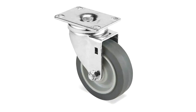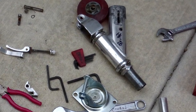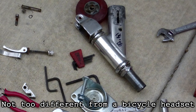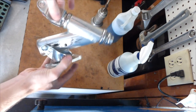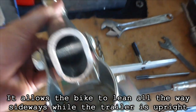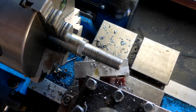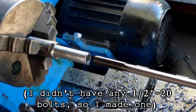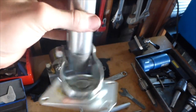Now let's look at the trailer hitch. A lot of those Instructables guides recommended using a swivel caster for this part, and I partially used this idea. The only difference was I added an extra layer of complexity by throwing in a scooter handlebar bearing. This allowed the trailer to have more degrees of freedom — in hindsight this was kind of unnecessary, but I figured I was already over-engineering this thing enough as it is, so it couldn't hurt. I had to modify the scooter part to accept the swivel caster's axle. I did this by machining a bushing — basically a half-inch bolt with a hole through it — and then attached it into the scooter part. This would take up any slack between the two components.